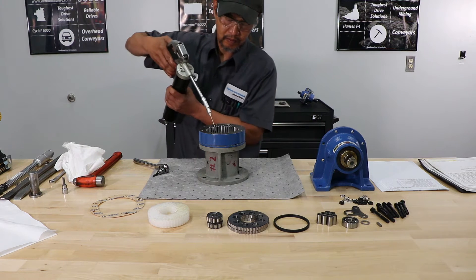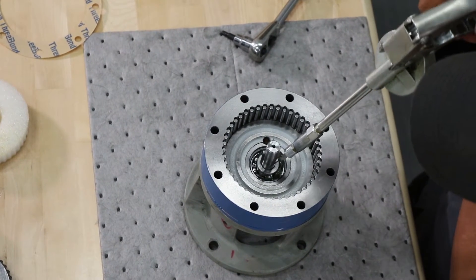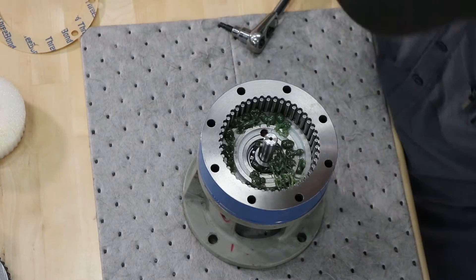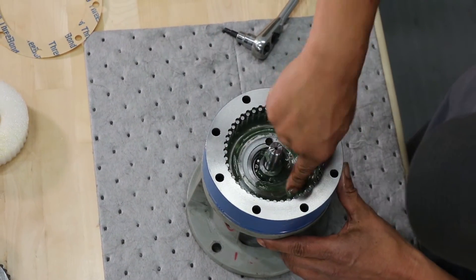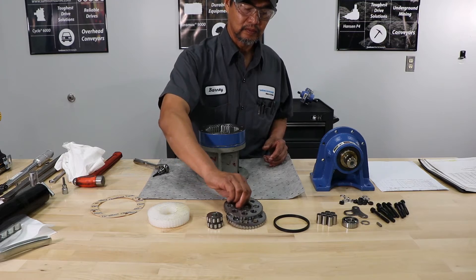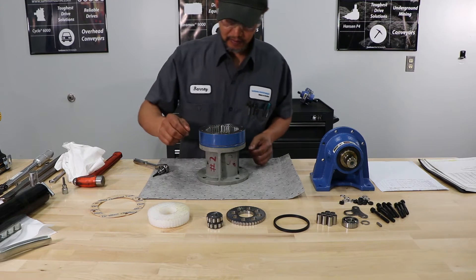It's good practice to go ahead and grease the lower bearing, which is actually the high-speed bearing — in this assembly we'll call it the lower bearing. You should put a good layer of grease before you install your first cyclo-disc. He's also going to run that grease around the rollers — in this case it's pins only. This also helps keep the pins and rollers in place when you're installing your disc. The first disc will go in. Always have your ratio stamped on there, usually a frame and also a set. We want to make sure it goes numbers up, and this is for the alignment of the second disc.